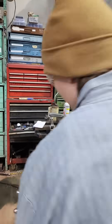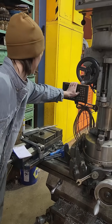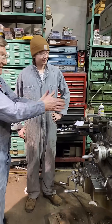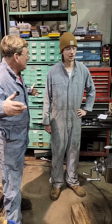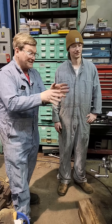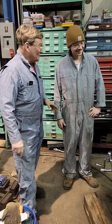Then come over here to your readout — zero, zero, zero. We don't really care about Z. So now we're at zero. Go one and an eighth inches out, and then you put in your holes. You're done. Especially on something that will get you within five thousandths of an inch. Sometimes we've got to check it afterwards, but you're there. For this project, this has got to be plus or minus a sixteenth of an inch — so you're there. We'll be right back.